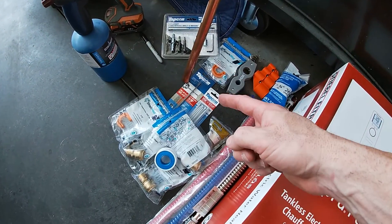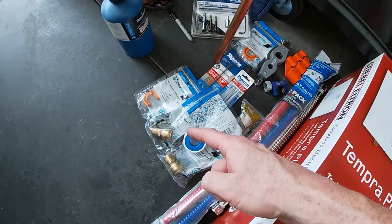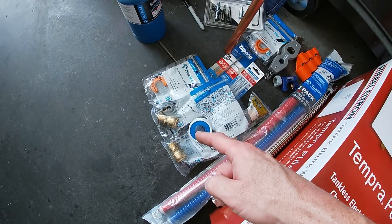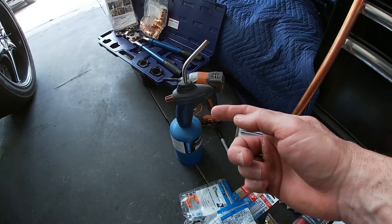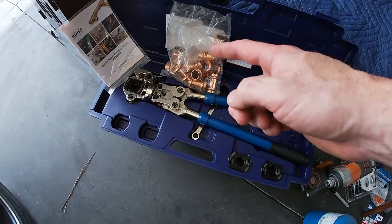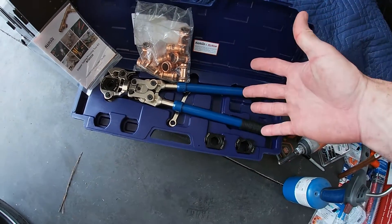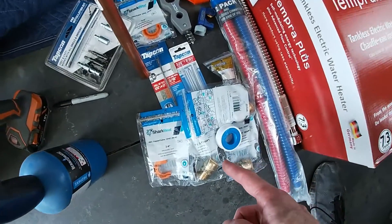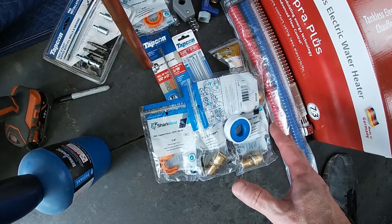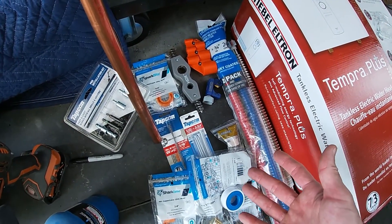To get the water heater installed, we've got some tap cons — we're going to go right into the concrete block. We're going to use shark bites, three-quarter inch shark bites, and a hose kit for a water heater. You could use a torch and sweat the pipes, or use something like this and crimp the pipes — it depends on how you want to do things. For me, I want to get this done quickly, so I'm going to use the shark bite fittings because everything is exposed, so if there's any leaks I'm going to see them. Everything shown will be in the description below.